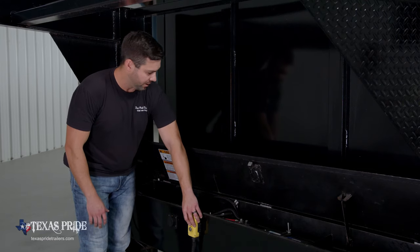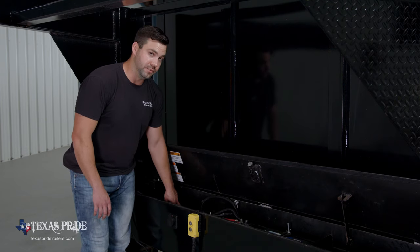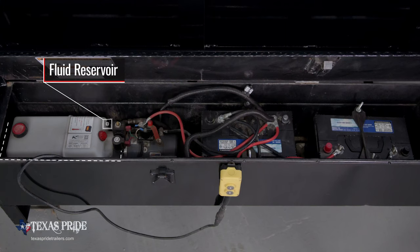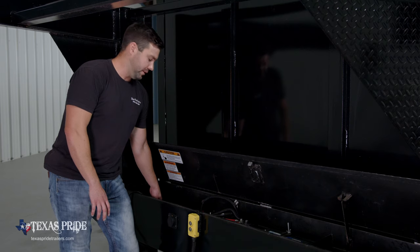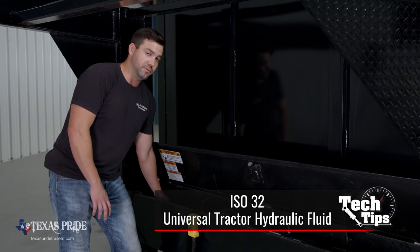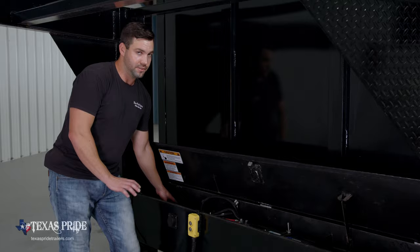When you control your hydraulics with your remote, it's going to take power to either one of these solenoids and then hydraulic fluid to the cylinders, and then it's going to go up or down appropriately. The reservoir itself is pretty straightforward — that's where the hydraulic fluid is going to be stored. If you find that you need to add hydraulic fluid to the system, it's known by either universal tractor hydraulic fluid or an ISO 32, which is the viscosity of the fluid itself. If you stick to those two designators, you can't go wrong.